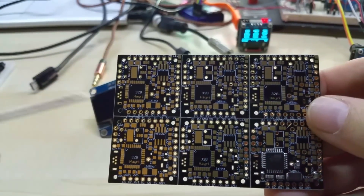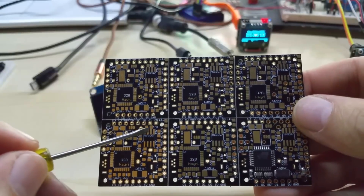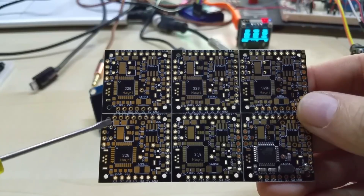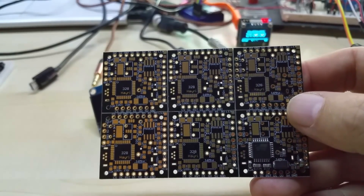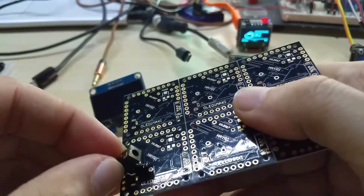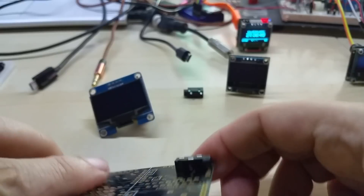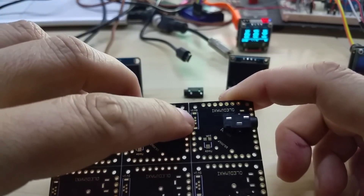I have a voltage regulator for the voltmeter and the gear indicator. This is the pinout for the MSGEQ7 chip, and it has the required parts for it. For the gear indicator, I have protection diodes. I can show you the 3.5mm jack — it can go either to the back, to the side, or directly out the back.